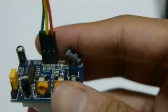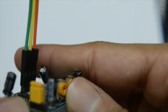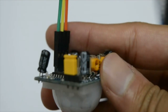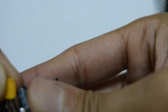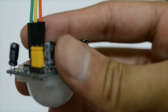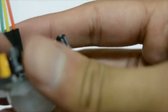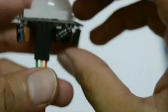One important thing is the re-triggering pin. Right now it's set to the last two pins, which means when the motion sensor turns on and the object stays in front of it, it will keep triggering continuously. If I switch it to the first two pins, even if the object is in front of the sensor it will turn off and then re-trigger again, which is not ideal for our project.